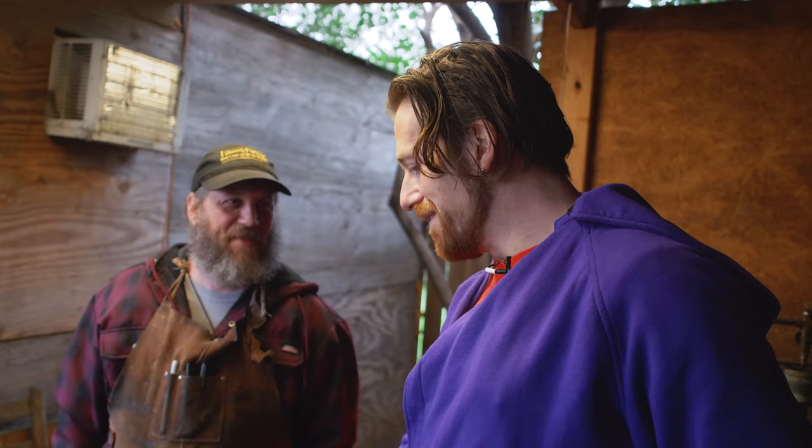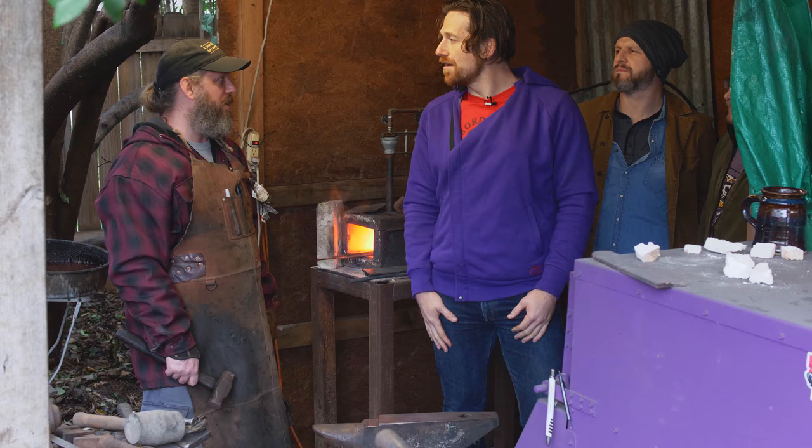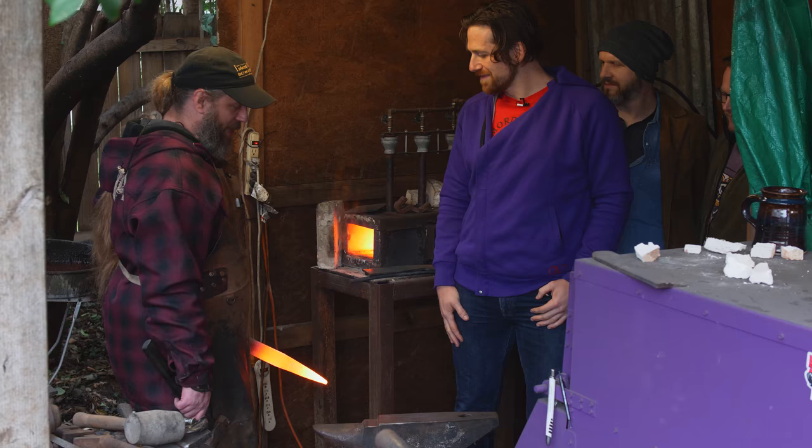So, watching you wipe down the anvil like that, I always wonder nerdy things like, how much material do you lose? Not much. From the carbonization? Like, have you weighed it before and after? Well, no, most of what you're seeing on the anvil is called scale. It's basically oxygen that's cooking on the steel. So it's like additional material that's then knocked back off. Yeah, you're not really losing much from the scale. It looks worse than it really is.